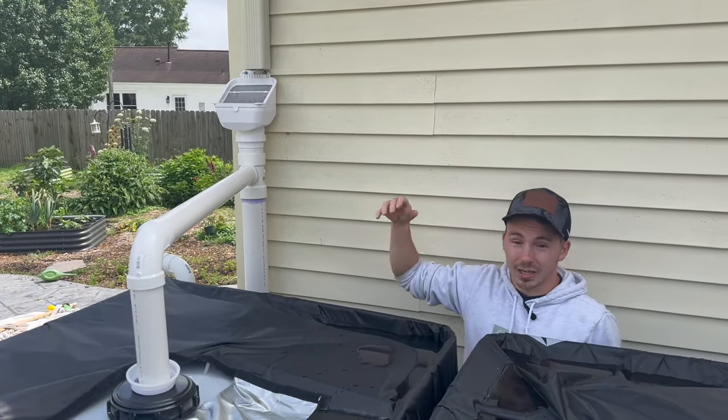So now let's say it's raining — this whole tube is completely filled up and it's starting to flow over into our IBC tote. I know there might be some sediment that comes over in that flow of water, especially if you're getting a heavy rain. So I added another fine filter. Come a little bit closer — you can see all that fine sediment in there. This filter is very, very fine — a fine nylon mesh filter — and this is the type of sediment it's catching. You always want to keep your water inside your IBC tote as clean as possible, so having these multiple stages of filters and sediment traps is what allows you to do that.